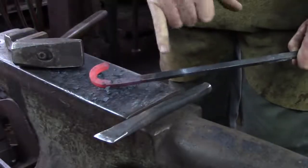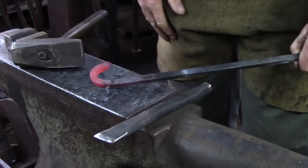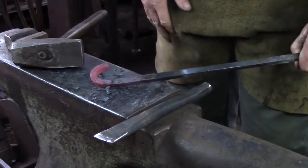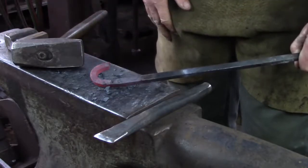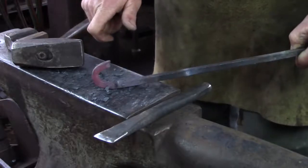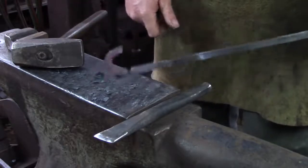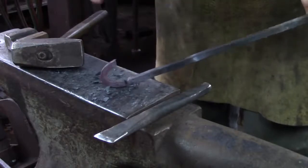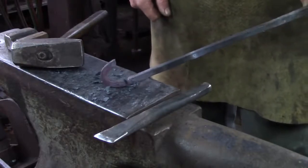I'm going to leave the collaring stock onto the bar because this now acts as a handle, so I can take a heat with this in the fire without risk of losing my collaring stock. When I come out, I'm going to take a pair of scrolling tongs, wring that off, put it in the step. I've preheated my basket twist so it will fit in, and then I'll close the collar stock around it.